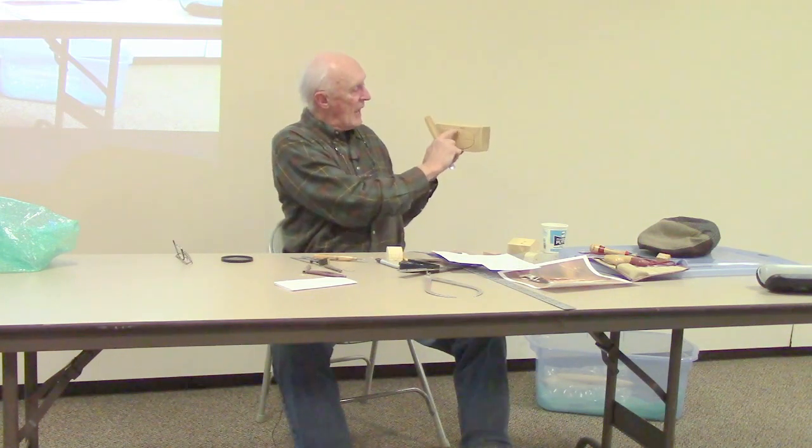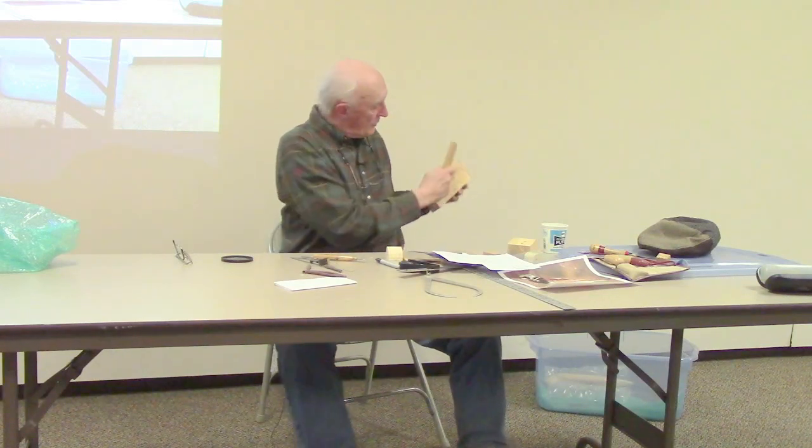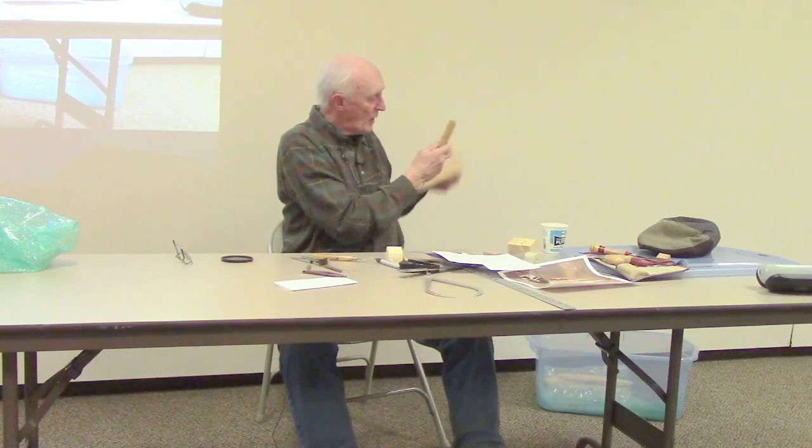Oh, if you're using cedar, every time you get a slope, slow down. Because if you go against that slope, you'll just pop the wood right out. Otherwise, you can just kind of keep whittling it away. Like when I do the sides of the bird, everything from about here, I whittle this way. Everything back, I'll go this direction. Same with the body. You have to start right about like here, because it's dropping up, whittle back, go with the grain that way, up here, turn it around. Tupelo isn't that tricky.